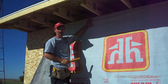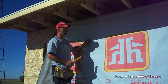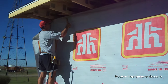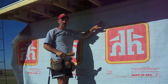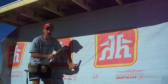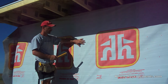It's nice to get it hanging as straight and level as possible for the wrinkles. Also if you notice on the house wrap there are these little squares, and that indicates the amount of staples that you need and the position of them. So it really helps — you don't have to measure anything. They're about eight inches apart it looks like. Now I've got it hanging, stapled at the top, we've got it level. I go usually about in the center of the sheet, just smooth it out, pull the wrinkles out and get the staple in just to get it hanging. You can see how that's nice and flat there. If you get it all wrinkled up it just makes it harder for siding and everything else.